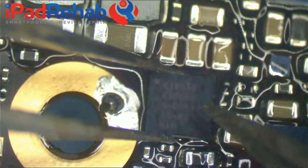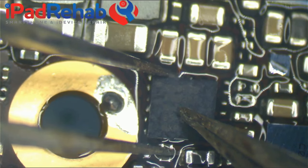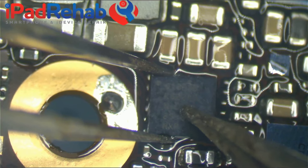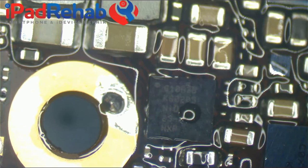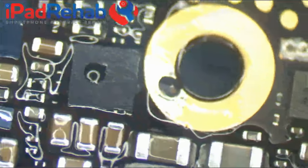And that can cause disturbed joints if you are trying to heat something and then it sort of nudges or moves around as it cools down. So having the 6337 would be ideal if you had to pick. But honestly, if you already have a bunch of 6040, you probably won't notice a whole heck of a lot of difference.